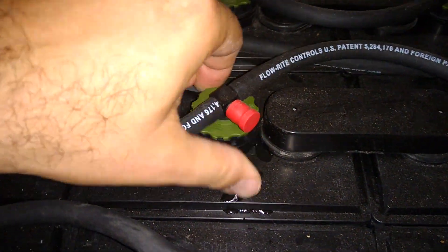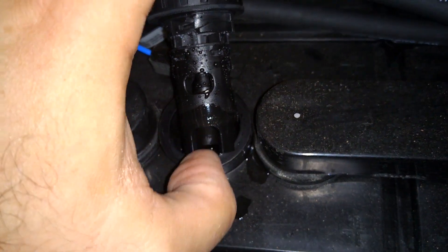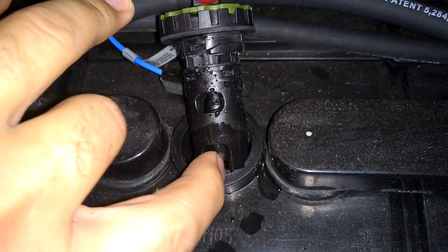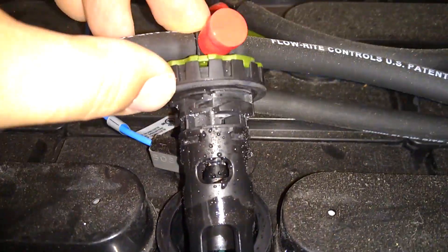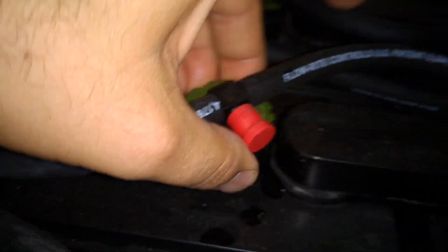This is the one I had open — I want to show you guys closer, with some light, what this thing actually looks like. So, just like in a carburetor, you've got a little float right down here. You can see it moving up and down in there when I move my finger a little bit. So it floats up, and then that closes the valve, and that's what keeps more water from coming in. Basically, the water comes right up to there and stops, and that's why we didn't have water spraying all over the place when the pump was running.